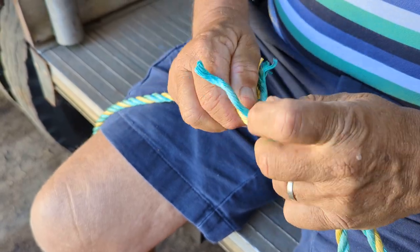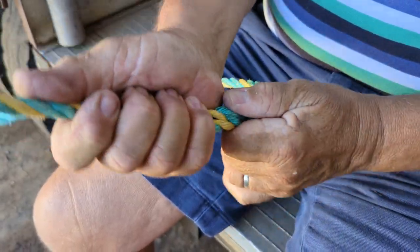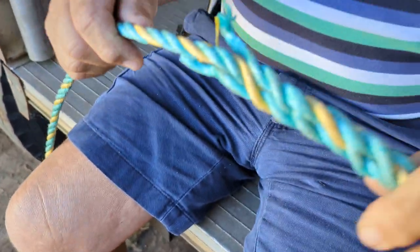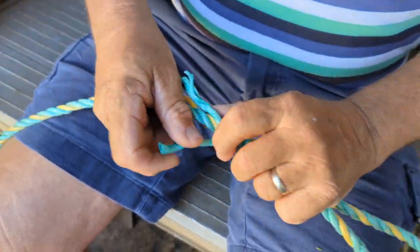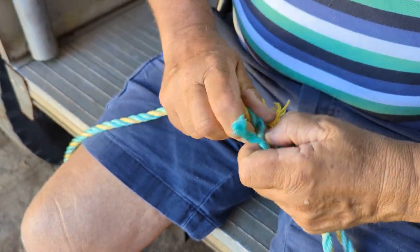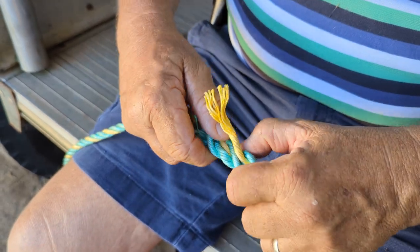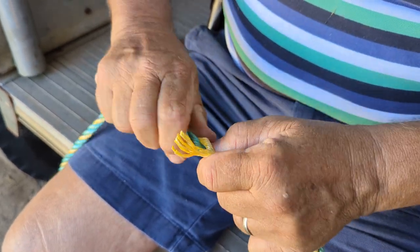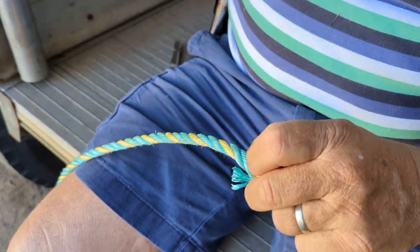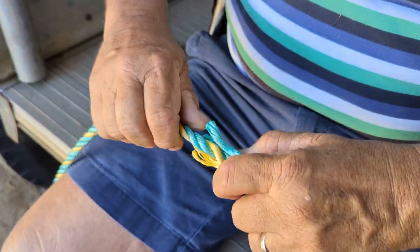That's the yellow. Roll it back flat — that's three. That's strong enough for all practical purposes. The fourth one is just a bit of bibs and braces, and that's all you need to go — you don't need to go any more than that many. Basically the tighter it pulls, the tighter it pulls on the splice. You can go as many under splice as you like, but after three you get no increase in strength.